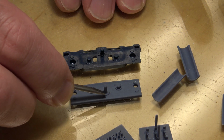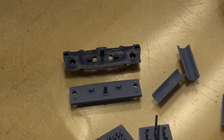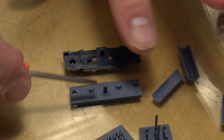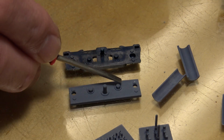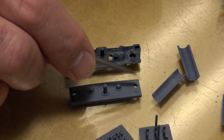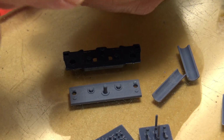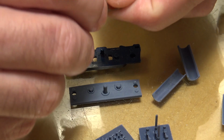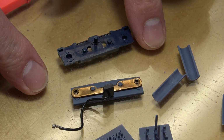around the pin that, what do they call it? You know, the bottom, this clip goes over and holds this thing in place, holds everything in place. So I've got that pin, I've got these pins that go through these large holes, and then these holes here are to locate the axle centers. So these are, of course, the axle centers where they go through the pickup strip. So if I put that on here, they fit perfectly right in there.